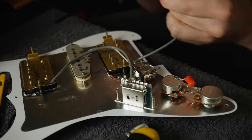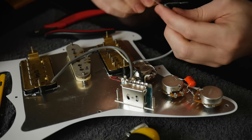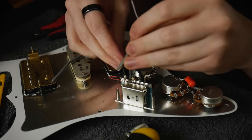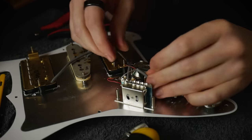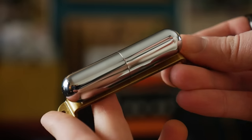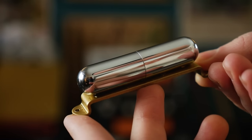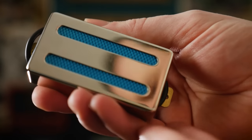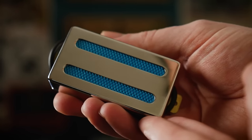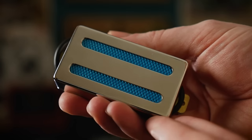What has this got to do with pickups? Well, the brass baseplate will be capable of sapping energy from the pickup in a dynamic fashion as the strings move. This will affect the overall inductance of the pickup as you play, and you have a pickup that sort of responds to what you are playing in a subtle way. The same rules apply to covers — you are encasing the entire coil in metal, and how transparent that metal is to a magnetic field will change how the pickup views the strings. There's also the factor that with covers the coil will sit slightly lower compared to the strings, at least by the thickness of the cover. Removing the covers can make the pickup sound a little hotter and more aggressive, though mostly the covers are an aesthetic and shielding choice more than a sonic one.